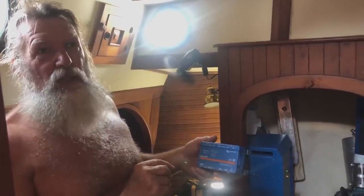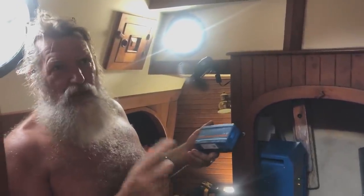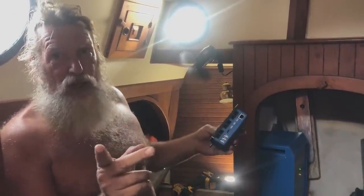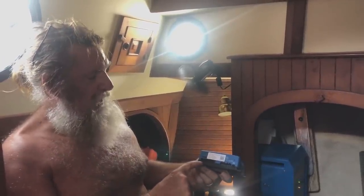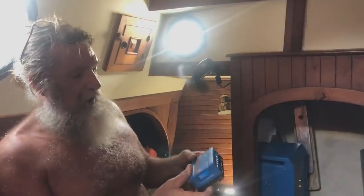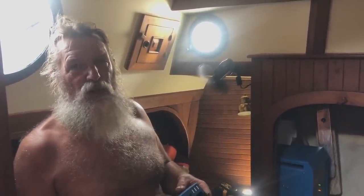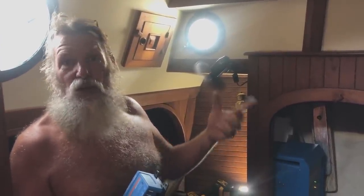I've got to put the smart shunt in. It's going under where I'm sitting. The smart shunt goes into this and tells us how much current we're using in both directions. Then this is Wi-Fi, Bluetooth, everything else. It talks to everything, LAN, talks to the plotter. It talks to our onboard Wi-Fi system. It talks to the fuel tanks, water tanks, bilge pumps, alarms. It talks to pretty well everything, and sends all that data into a central hub for our info, which is on your phone, on your iPad, on your laptop, wherever you want it, in the cloud.